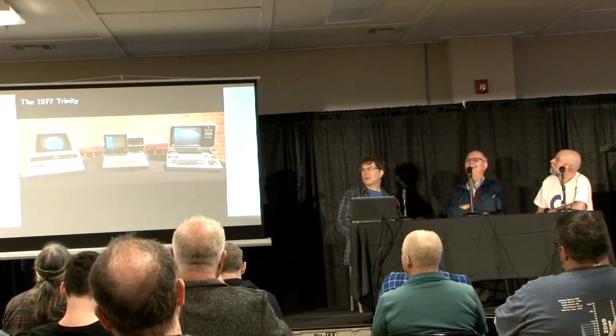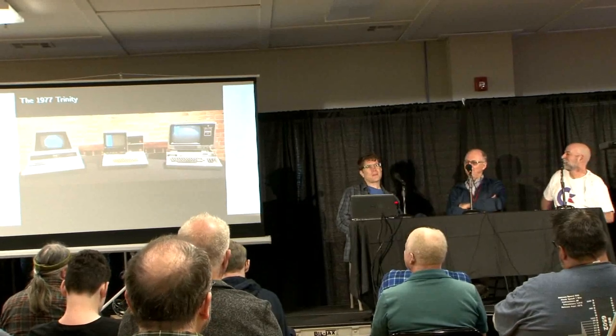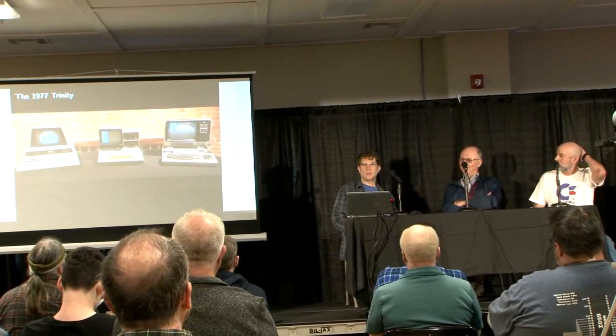The Apple II, this evil thing, if you heard Berger Becky's talk, the color was actually quite deliberate. It's essentially what happens if you send frequencies at the NTSC color burst frequency. So that actually had color, it was a nifty thing, but brutally difficult to program. And then the PET had this wonderful PETSCII font built into it that you could do all kinds of crazy things with, but again, it was sort of a character-based thing. We called the Apple an artifact generator because of the way the color was generated, based on the interference with the frequency of the color burst. Yeah, when a frequency meets another frequency, that's a moiré.